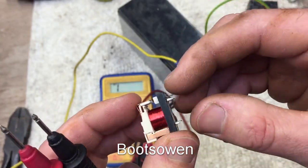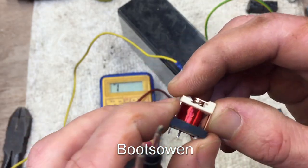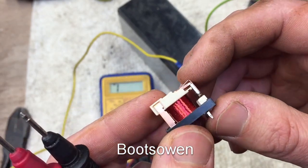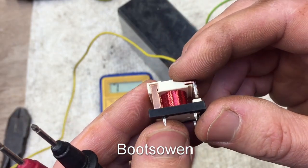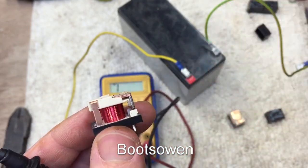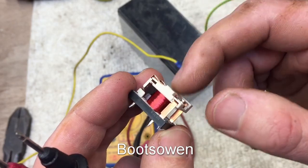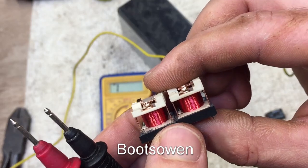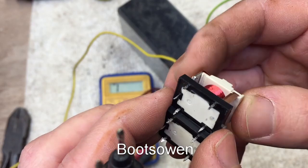But that's my little investigation into what went wrong with this machine. From the people who commented and watched my other videos, whenever this machine originally went into service and did a wash, something happened where the suppressor — the noise suppressor — blew. That must have sent a shockwave or some kind of high current through the circuit board, and it hit one of these two little relays. It hit the solenoid but broke the relay in that case.